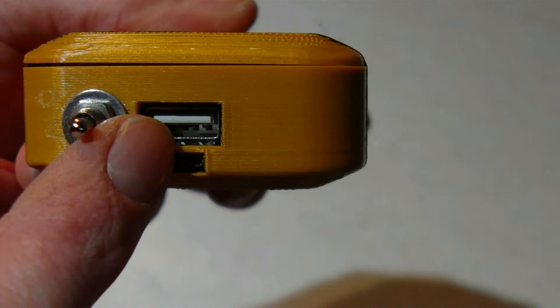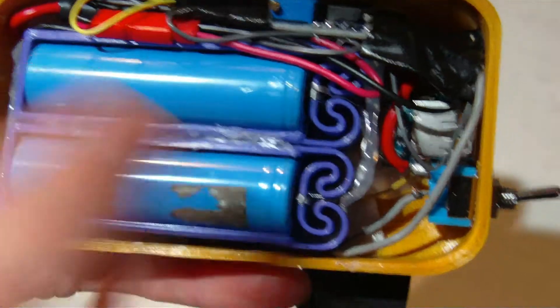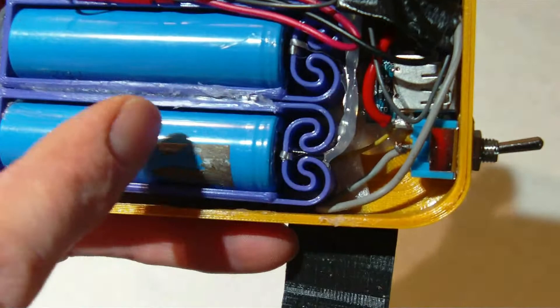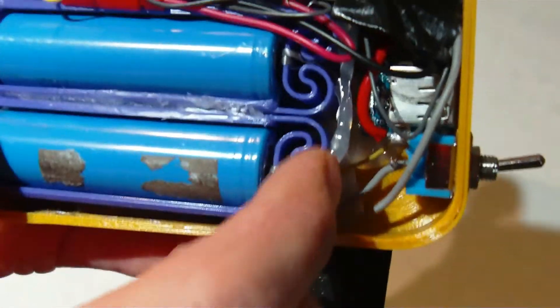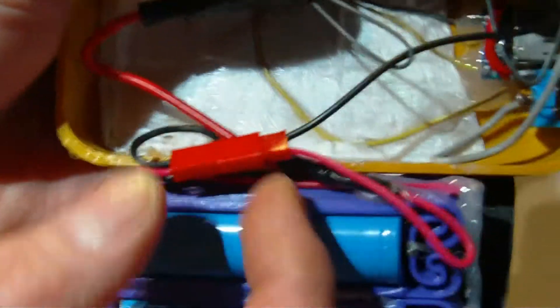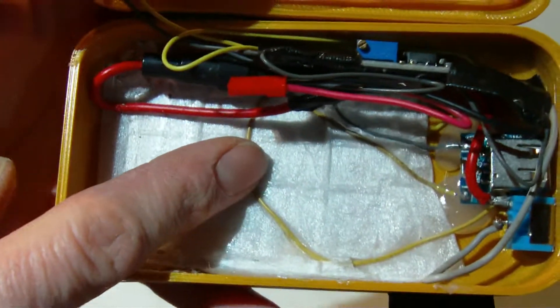We have our micro USB to charge, USB out to power up or charge your phone, and then there's an on and off switch for the heating elements. I only taped it because I didn't want to glue it shut so I can show you what's in here. We have two 18650 batteries and two Flex 18650 battery holders — they're 3D printed, found on Thingiverse, and put together into a double battery pack. There's a JST connector so we can unplug the battery pack, and the rest of the components are basically just squished in there.